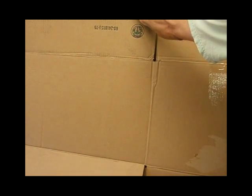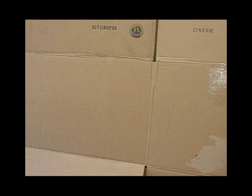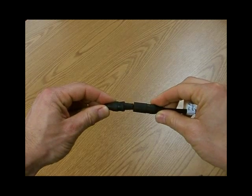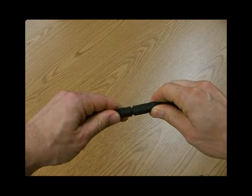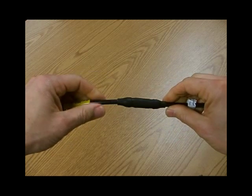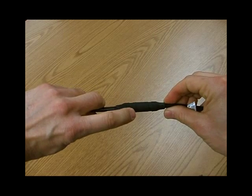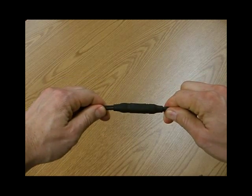Using MC connectors is simple. Before you begin, cover your solar modules to prevent electrical arcing. Better yet, make your connections when the sun isn't shining. To join connectors, just line them up and press them firmly together. There will be some resistance created by the ridges on the male connector. Make sure there's no visible gap where the connector sheaths butt together to assure a weather-tight link.